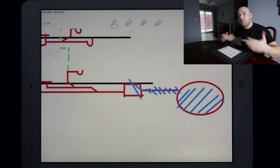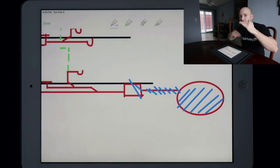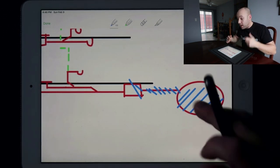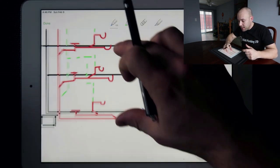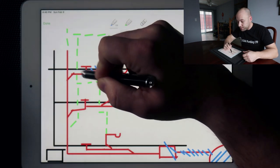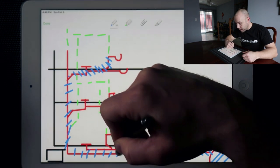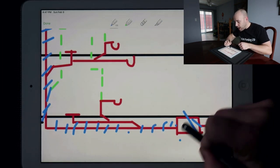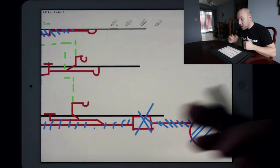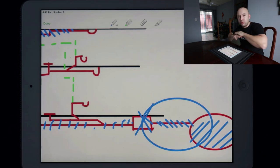But if you're dealing with a commercial unit and a residential unit above, the residential unit and the unit below aren't in conversation with each other, so they have no idea what's happening with the water downstairs. So what will occur is these units above will continue to run water. So they'll run water through their vanity, and it'll start going down the stack, and it'll start filling up on the inside. Now remember, this valve is completely shut. No water is going out and no water is coming in, because on the other side of this valve, it's completely filled with water. So getting water to push through is not going to happen.